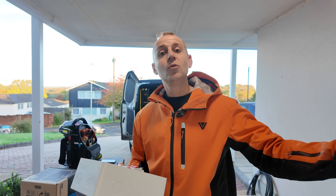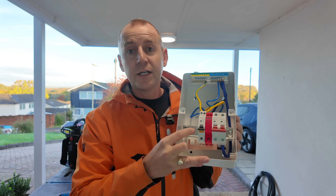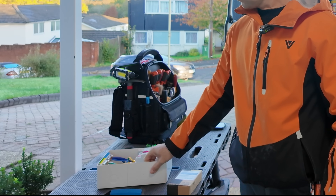Bear in mind: down the line everyone's going to have two electric cars. If you've already future-proofed it and told the customer, the chances are they're going to call you back for the second charger. And before I forget — the breakers you install should be 40 amp bi-directional RCBOs. The reason is future-proofing for vehicle-to-grid: if we ever go down that route, you need a bi-directional RCBO for the protection to be relevant.